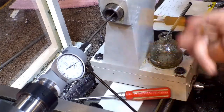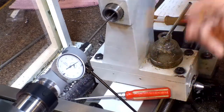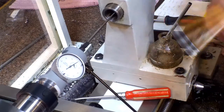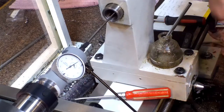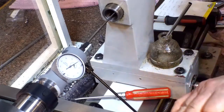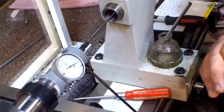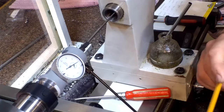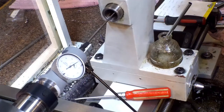I got the chuck centered pretty well. On the coaxial indicator I was getting 3.5 ten-thousandths of an inch out on the chuck. Then I swapped over to the tailstock — dead center, live center — and they all read the same. So I believed the tailstock internal is good, and the live center and dead center are all machined correctly.